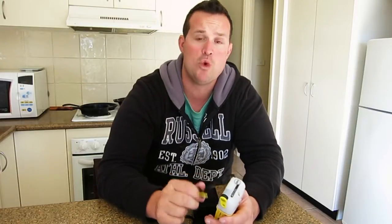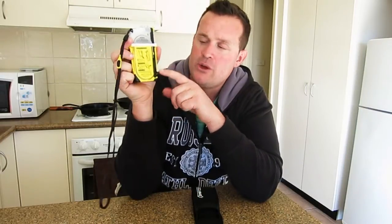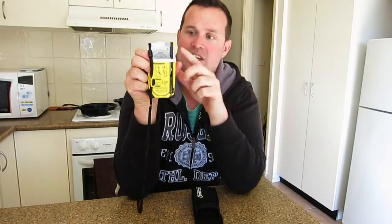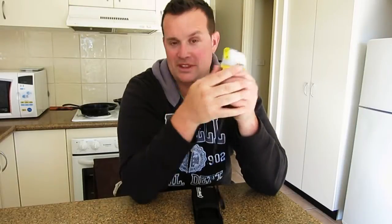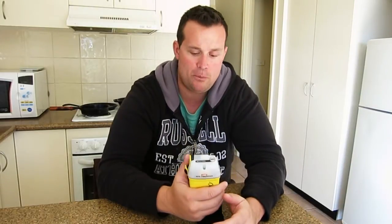Don't do that GPS test more than once a year. To set this beacon off, you'll see there are antennas in there — you push that button in and it'll flick up, and you lock it into position. I think you have about 60 seconds after setting it off to put the antenna back in to stop it from actually transmitting. So if it does pop up accidentally, grab your key on the lanyard, push it in, pull the antenna down, and lock it back into place — that will stop it from contacting emergency services within 60 seconds.